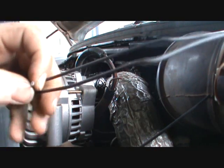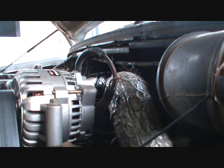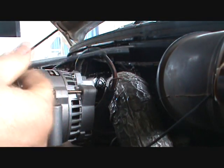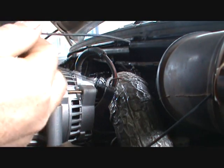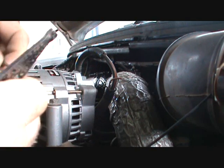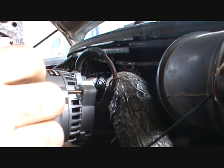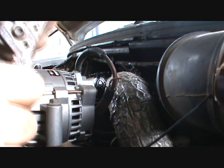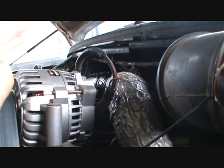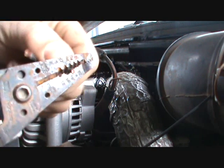What I'm going to do is come back in with some liquid electric tape that I'm going to put over top of that thing. I'm going to slide on my heat shrink tubes up here. I don't want monumental amounts of wire sticking out, so where Ford had bent these wires, I'm going to cut them off flat. Try to keep things the same length because if you don't, you have a tendency to have the wire kink, and where things are kinked and they move, they have a tendency to actually break inside. You just really want to be careful with kinking — you don't want any kinks.